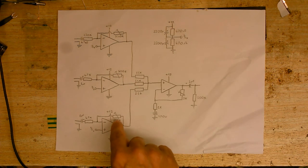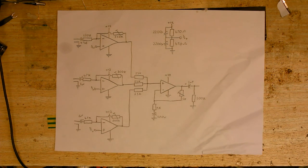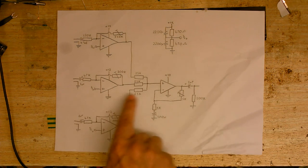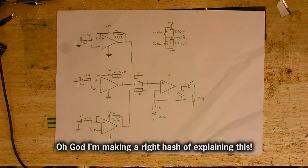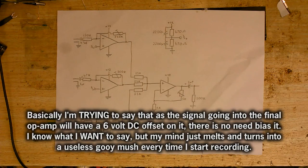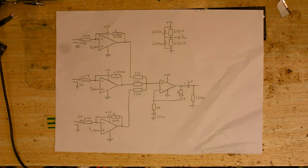On each one of these we have a trimmer to adjust the level. This isn't going to be a proper audio mixer — it's more of a set-and-forget kind of thing, because once I've got these levels set I'm not going to do anything else with them. The output amplifier is set up in a non-inverting configuration because it would just be easier to set it up that way. I don't need to worry about biasing it because all of these are going to be at half the supply voltage, and I only want to amplify those fluctuations — that's why this capacitor is here, which I forgot in the meter design.